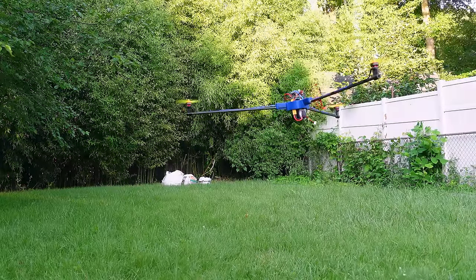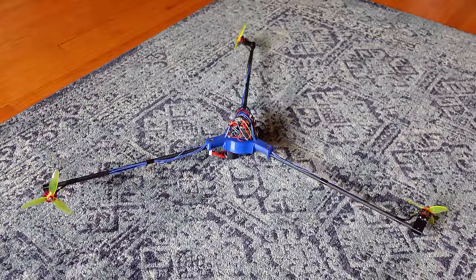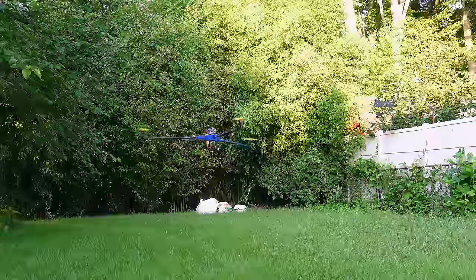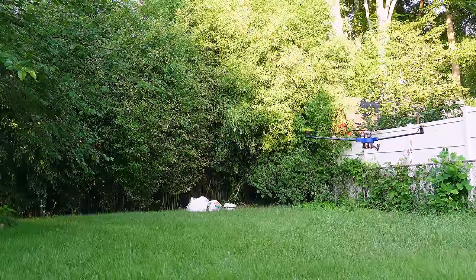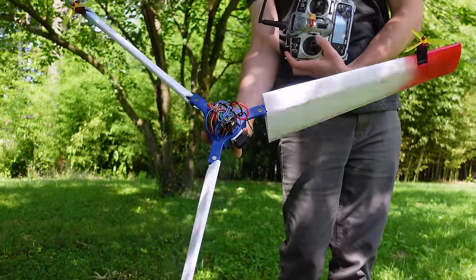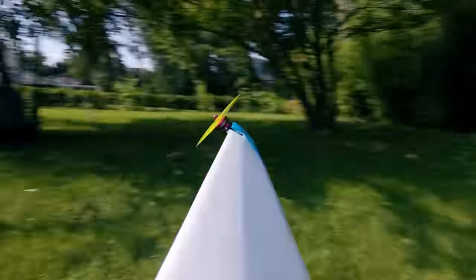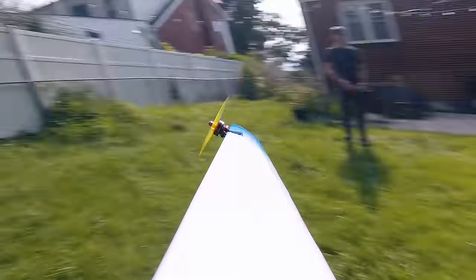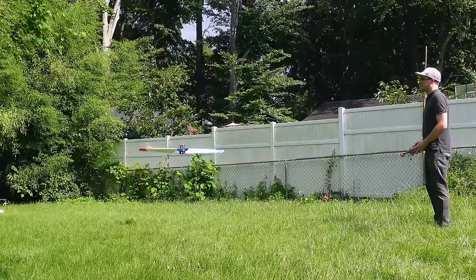This might look like just a regular old tricopter drone, but unlike a typical tricopter, all of the motors tilt with a single servo so it can spin at extreme speeds. Why would I want it to spin so darn fast? When fitted with some wings on the arms, and when the tilt angle of all of them is just right, it actually requires substantially less power to hover than if the three motors were just oriented vertically like a regular tricopter drone.